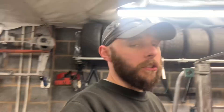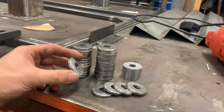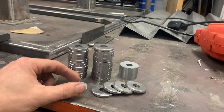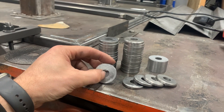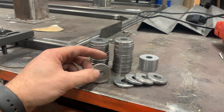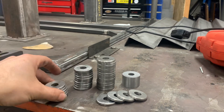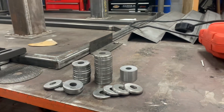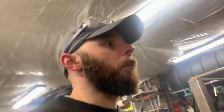This is just going to be a quick collage on a bit of machining - making these. To most people it's a simple washer, but I like to make a few of them because another fabricator I know wants something you can't actually buy. This is five millimeters thick, a half-inch precision hole through the middle, chamfered. We use these for radius arm mounts - it's the adjuster for the radius arm. So let's take a walk into my machine shop.